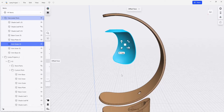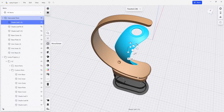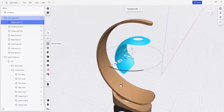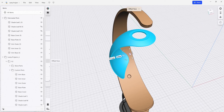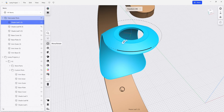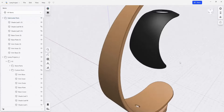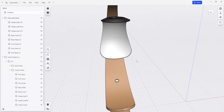This outer leaf here of the cover — I am going to rotate this a little bit to get it back to center. I'm going to select the part, move the control node to the circle, which centers it on the circle, and I can now rotate this 60 degrees. That looks pretty centered, so we're going to leave it there and use that location to help us cut a line of symmetry to generate our tooling.